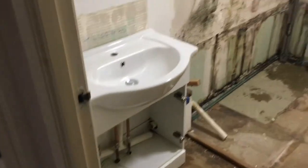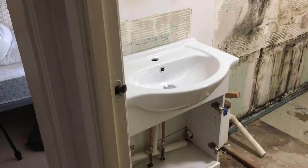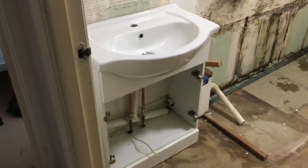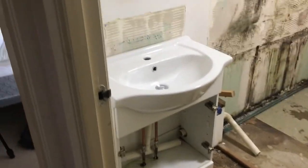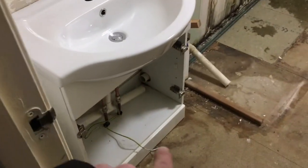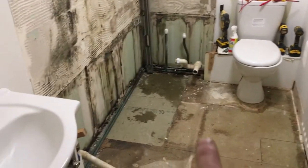Right, that's me finishing here for the day. Just a quick tidy up — pretty much got the vanity unit plumbed in, with a few loose connections still, but it's in the area I want it, all the pipes in the area I want. It's pretty much ready to fit properly. As I said, I'll leave it loose till I get the flooring done. The toilet also needs to come out to get the flooring done.